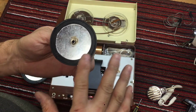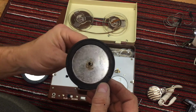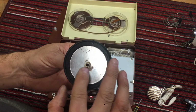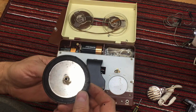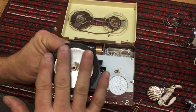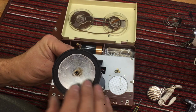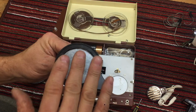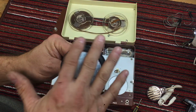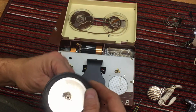If I could grind this or sand this down to where I could glue another lip on there, that might be the answer. So I need to ponder this. The other problem I have with 3D printing soft material is that it's a challenge to get a nice smooth surface. Although it just occurred to me that the surface that will be facing up will be the surface that prints on the print bed, and that will be glass smooth. So I could flip it over and have a glass smooth finish to work with. And if I used some kind of rubber cement to glue them together.